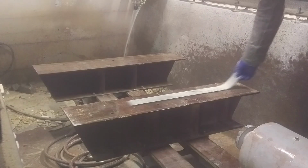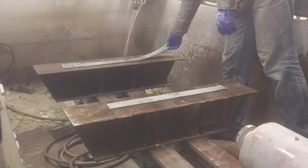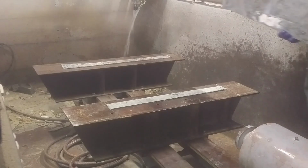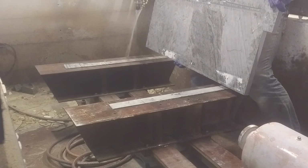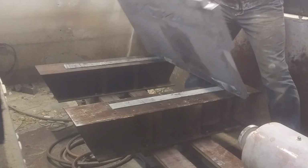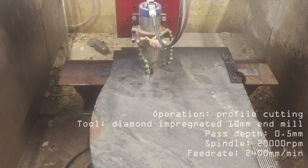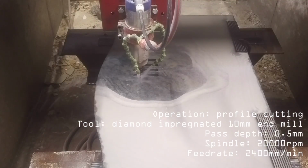And back to CNC. Since now the part will lie on the polished side, I lay rubber pads so as not to scratch the polish. And maybe someone will say, it's granite, how can you scratch it with the steel table? And will be wrong. On a steel table, granite really cannot be scratched. But with the small diamonds that could fall out of the tool during the previous processing, easily. So it is always very important to wash the table well from the sludge of the previous processing and use pads if possible.